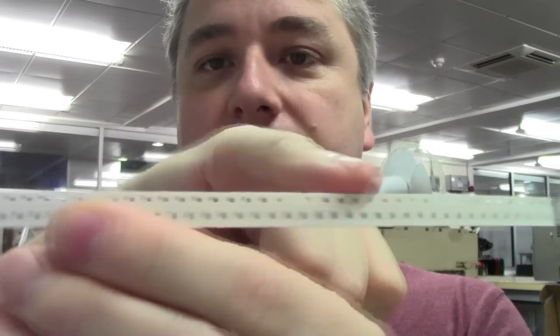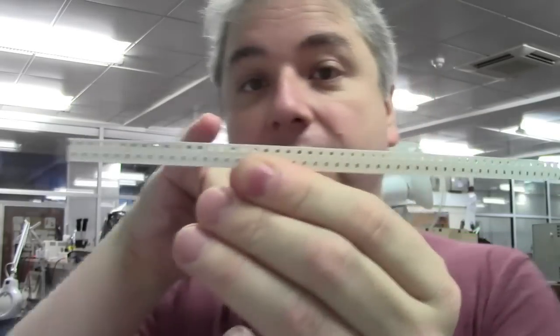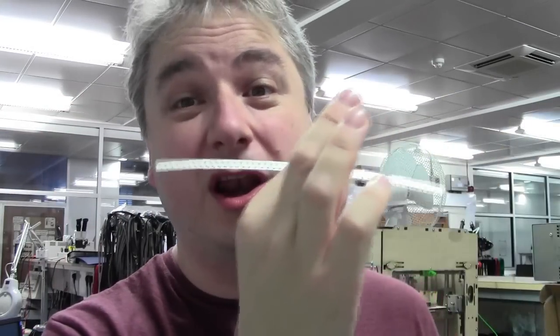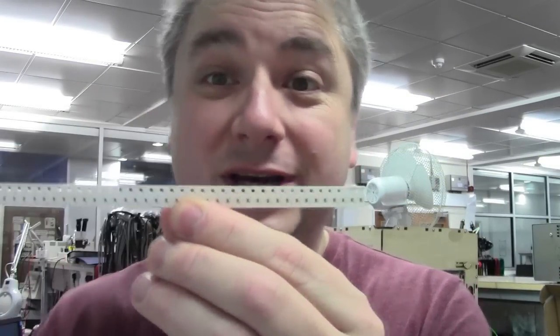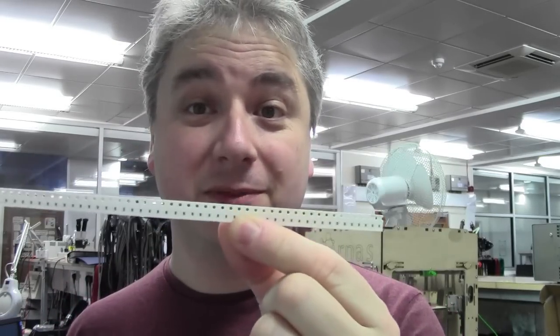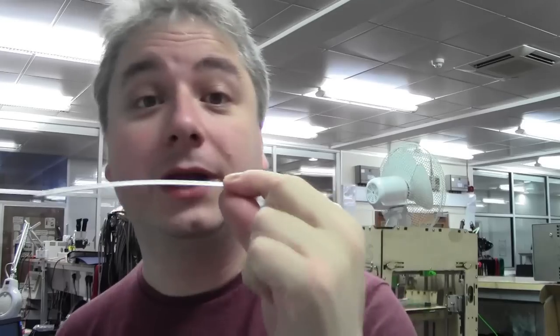Holes along the top are called the sprocket holes. The pick and place machine uses the sprocket holes to advance the tape down the lane, okay, into the feeder channel where your tape sits. It also uses the sprocket hole to align the tape to present the component always in the same position for the pickup head. So this distance you need to know is 4mm. So every time you advance the tape manually, you're advancing in 4mm steps.